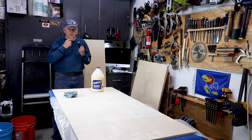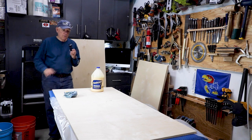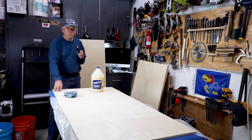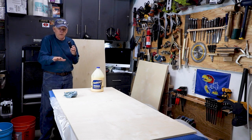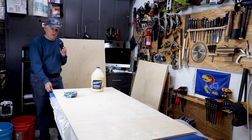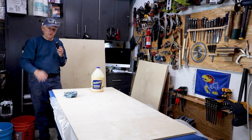I've got a little sound recording device since I don't have my lavalier on. Here's what I've got: my 30 by 60 half-inch Baltic Birch. I'm going to put glue on it, then set my 30 by 60 three-quarter inch Baltic Birch on top and get it all lined up, adding some clamps and using the weight of the heavier piece in lieu of a lot of clamps. I'm basically laminating my two 30 by 60s together — one half-inch, one three-quarter inch.